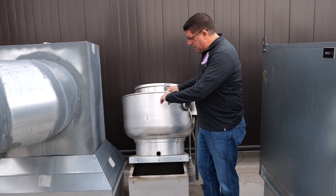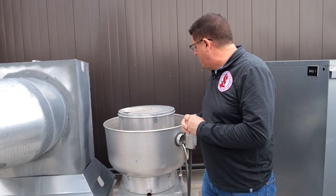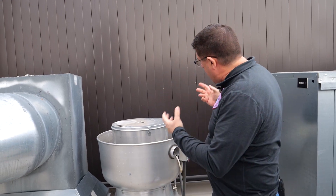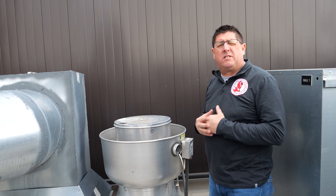Which it is, and so I can move it back. I'm not going to move fans that are in operation. So if the fan is in operation, I'm just going to take a picture of it, look at our electrical connections, look at our clearance. But if it's not in operation, then I'll look down the ductwork.